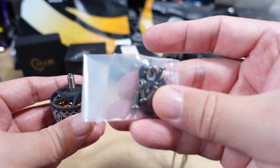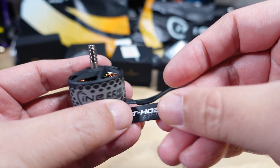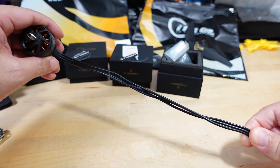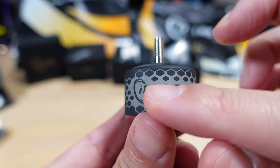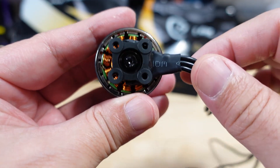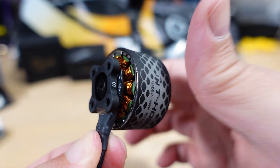Taking a look at the motor, it comes with a little packet of screws and nuts — fairly standard. The packaging is very similar to a lot of the T-Motor stuff I've reviewed in the past, just with T-Hobby branding instead of T-Motor. You get very long motor wires here, which should be plenty for a 10-inch build. The motor bell has a matte finish with sort of white paint with the name 'Cine 66 Pro 1100KV' on it. There's a little bit of cogging but not a ton, and the bearing is very smooth.